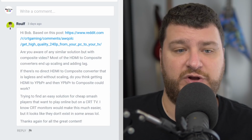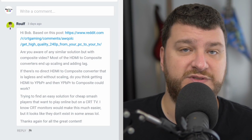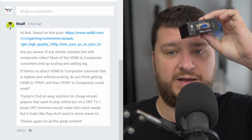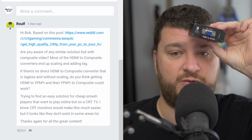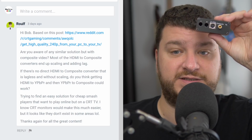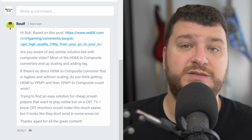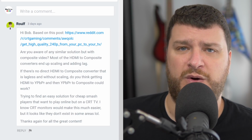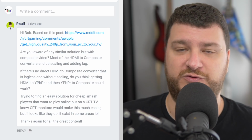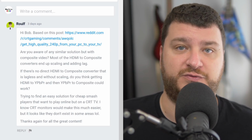Rolf was interested in trying to go from HDMI to composite video, and they were looking for different solutions that don't scale improperly or add lag. And there is a scaler out there from LinuxBot 3000 on eBay that can go from VGA or RGB to composite video. I've never tried it before, but you would obviously need to feed it some kind of 240p signal. And that link that you provided shows how to have custom timings on NVIDIA video cards to do, I guess, what they call super resolution, a really wide horizontal resolution with a normal vertical resolution, 240. And that fools most CRTs into thinking it's just a standard 240p signal.